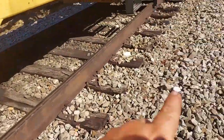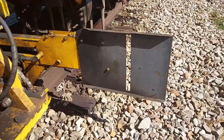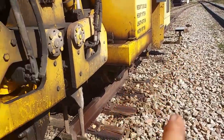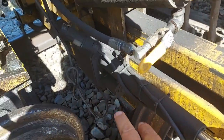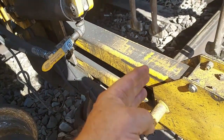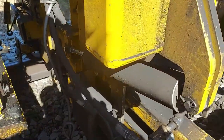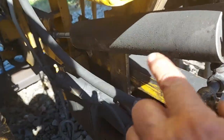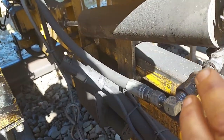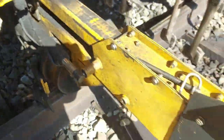When I'm lining track, we're shooting a beam off of here — this is all a 24-volt system — shooting the beam back through this bottom mask to the receiver. This is called a lining actuator, and it moves this mask back and forth as I'm going down the track, trying to find the light. This right here is my shift cylinder. When we throw air on it — like I should have now — it should be pushing this whole mass over against the other rail, but that's not happening because my valve is bad back here.